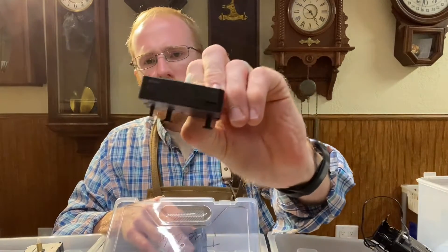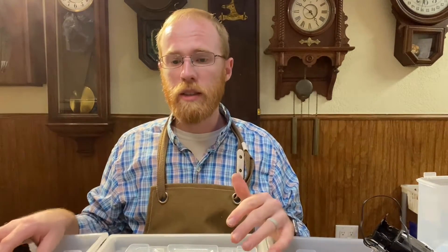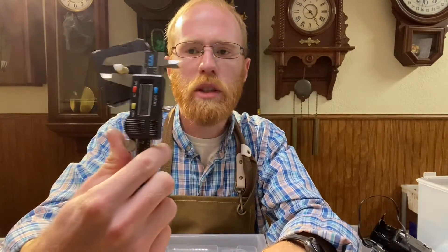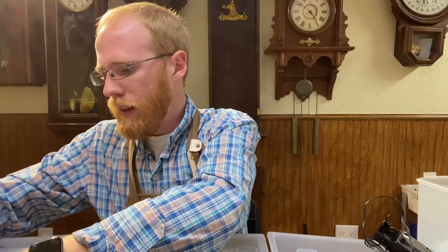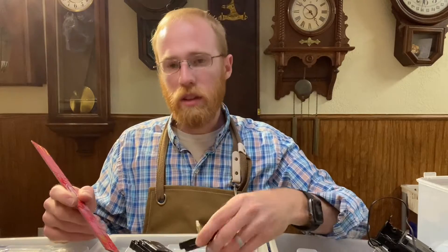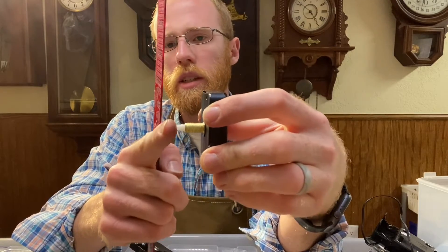There are also smaller push-on hands, like for little alarm clocks. Now you know what the functionality is and what type of hands it has. The next thing you need to know is the diameter of the shaft — that shiny threaded shaft. Most of the time it's about 8 millimeters, about 5/16ths of an inch diameter. Every once in a while you'll run into one with a larger diameter shaft — about 10 millimeters, or about 3/8ths. The next thing, and this is one of the most important things, is the shaft length — the length of the hand shaft. What we're talking about is the length from the face of the movement to the end of the minute hand shaft.